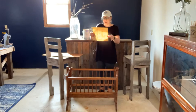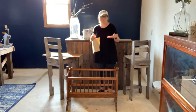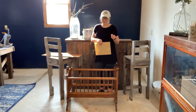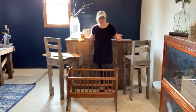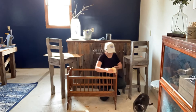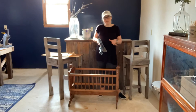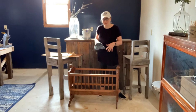Now that this has dried, I'm going to rough it up a bit with this 220-grit sandpaper. When painting furniture, the best advice I've ever received is that you get what you give when you prep your furniture. Even though some paints say no need to prime or sand, it's always a good idea to still do it because it just makes the paint cure that much better. I'll use about a quarter of the sheet and lightly sand it. Now I'll take a microfiber rag and wipe it off to remove the dust before applying primer.